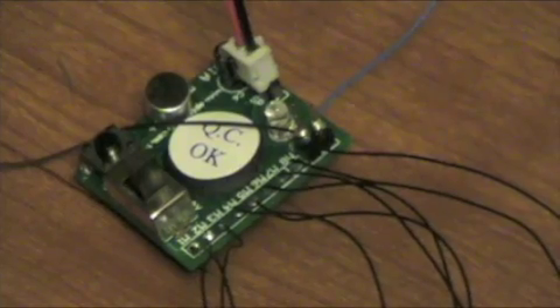As you can see, there's eight soldering points, message M1 to M8. On the back — and I'll show you this in a second — there are three jumpers that you have to manually solder depending on which setting you want to use. You can go into tape mode, where you have one long message, two-message mode, four-message mode, or eight-message mode, but you have to manually set the jumpers in the back.